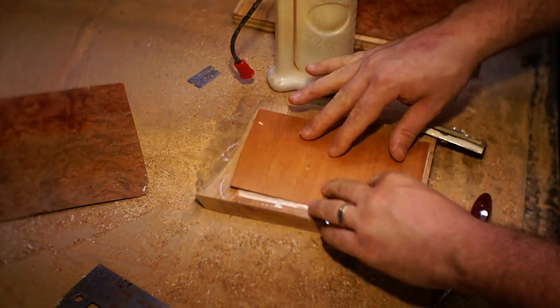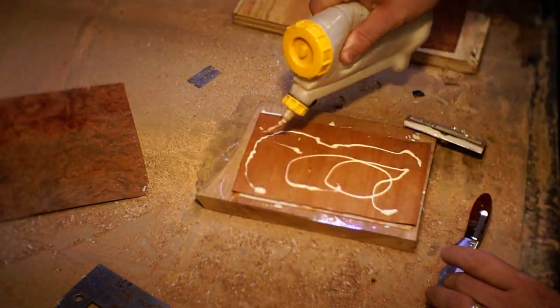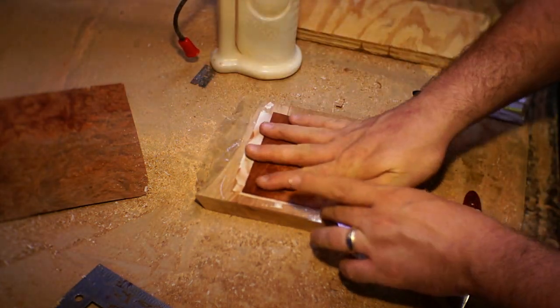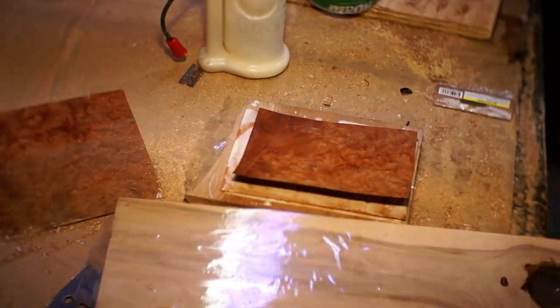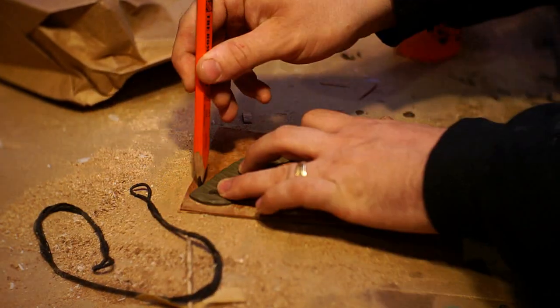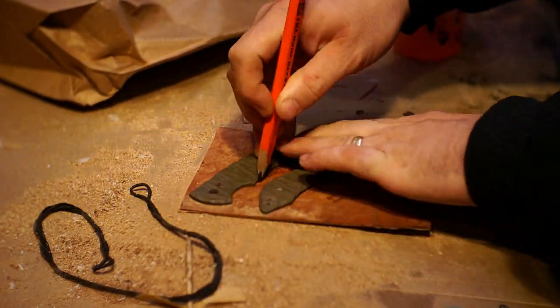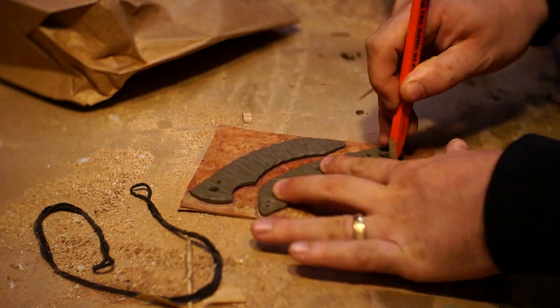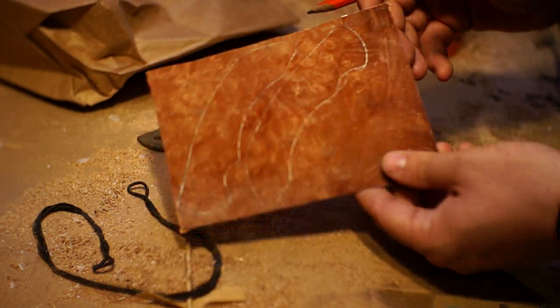The other good thing I learned from the mistake was that I did want to make it at least one layer of veneer thicker. Those scales didn't have much rigidity to them, so I'm using the figured wood on top and wood with directional grain on the bottom, putting those perpendicular to each other so there's strength against bending and cracking in all directions. This wasn't something I was getting paid for, but I still wanted to make sure it has some longevity and durability to it.